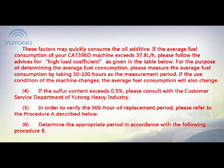For the purpose of determining the average fuel consumption, please measure the average fuel consumption by taking 50 to 100 hours as the measurement period. If the use condition of the machine changes, the average fuel consumption will also change.